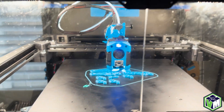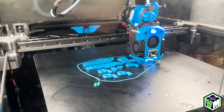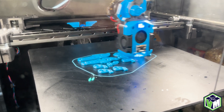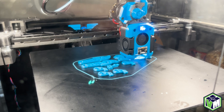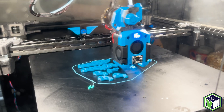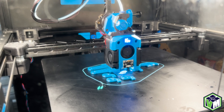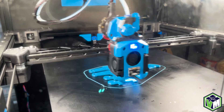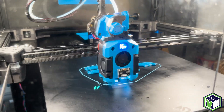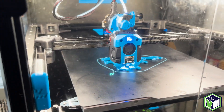One of the things I noticed early on was I was getting a little bit of overlap and gap on the surface of the prints. I don't really care about the first layer other than it bonding to the bed — it's all the speedy layers after that, layer two through whatever you're doing. You want good consistent flow out of the hot end. If you did rotational distance correctly and have the correct steps, what we need to be doing is going negative with the extrusion, not positive. In all my testing over the last three to three and a half weeks, the G2SA just works.